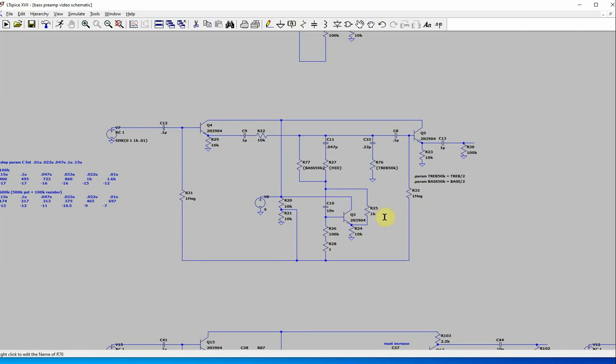So now the EQ is built here, but of course Jose wanted a preamplifier. Now, I have a couple of basses. I played bass for several bands, but I'm not real up to date on them. All I can say is when I play my bass guitar and put it on an oscilloscope, I get a voltage of about 100 millivolts on an old, low-level one. Then I have a Yamaha bass with passive pickups, and it's like 200 to 400 millivolts peak to peak, where the amplitude is 200.